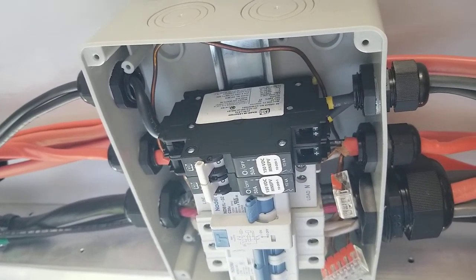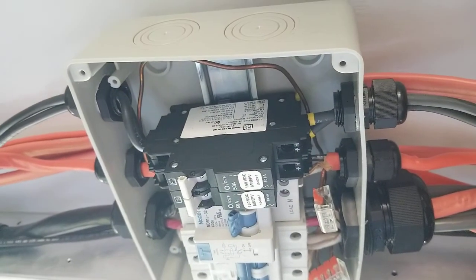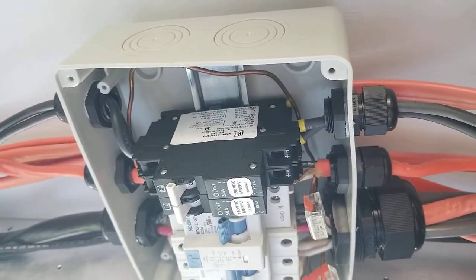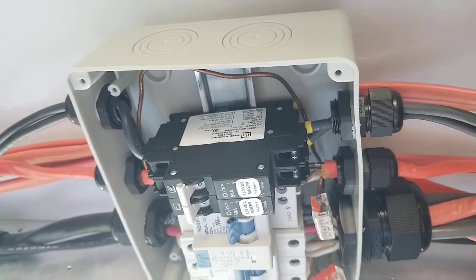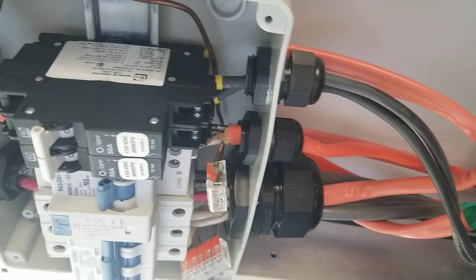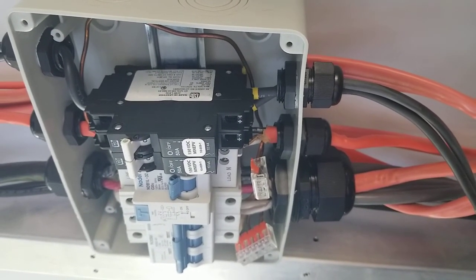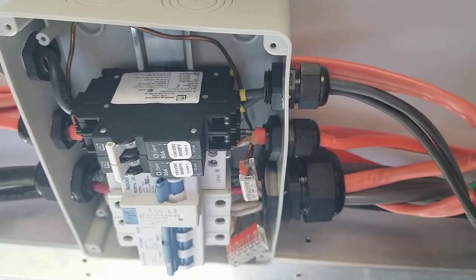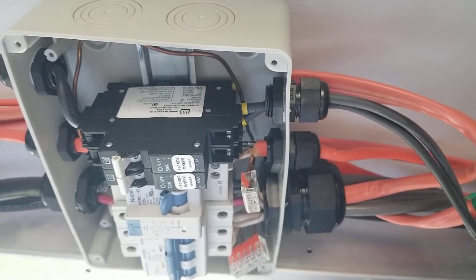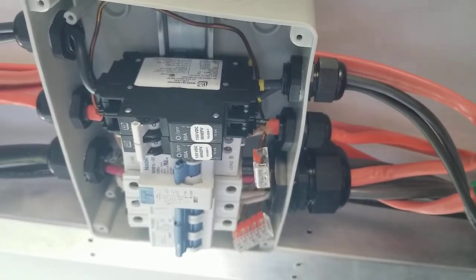like 4,500 watts of solar to this thing. If you were to use this in a residential application or go park this thing on a farm somewhere, you'd be able to hook it up to a very large solar array. And consequently, 5,000 watts of solar panels is only about $5,000, so it's not really outside of the reason of cost that you would want to do that and then just set yourself up full time.